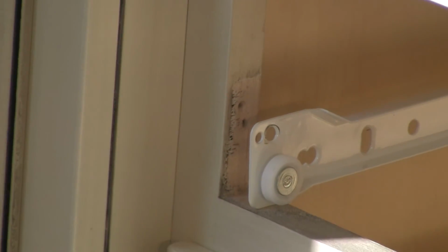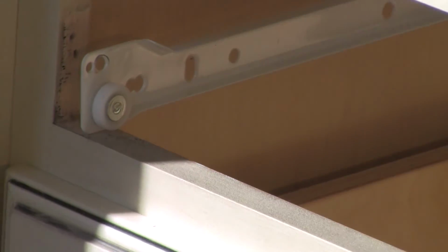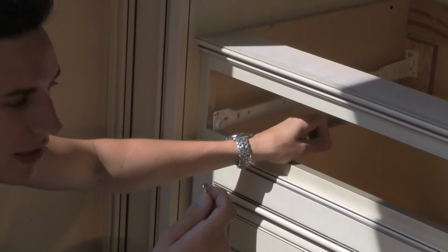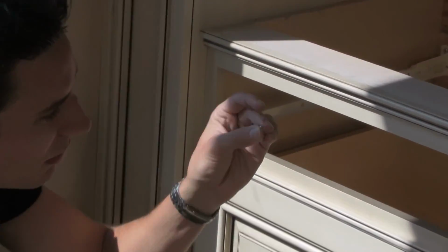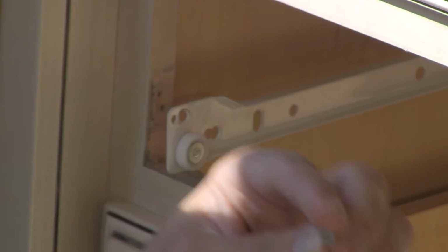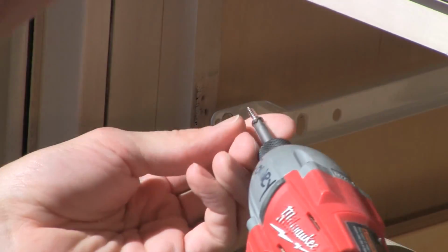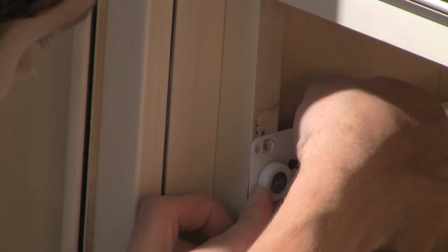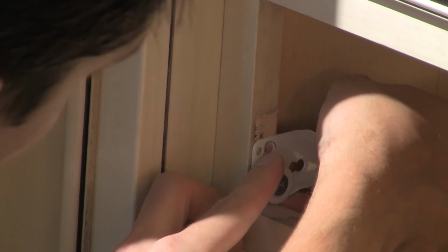Notice there? Notice how all the adjustment I have. I can pull it out, I can pull it in, wherever it needs to go. It should be pretty sticky, so that's going to be ideal. Take one of your 3/4 wood screws, not the pan heads like we saw before. We're using the pan head screws to attach that rear mounting bracket in there. We don't want these up front, we want these flat heads up front. So take that, and you're going to set the drawer guide back from the face of the cabinet by about 1/8 of an inch. So I think right about there.